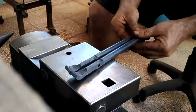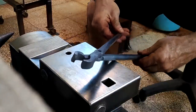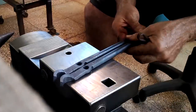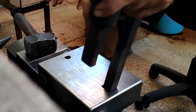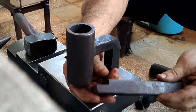If you watch my channel for a while, you probably know that I typically don't like using a tong for holding punches. It's mainly a manipulation issue for me, but I guess with the right pair of tongs and under the right circumstances, it probably could be advantageous. And with steel prices so high, it does make sense to use shorter lengths of steel, shorter punches if possible.